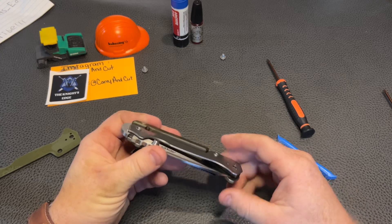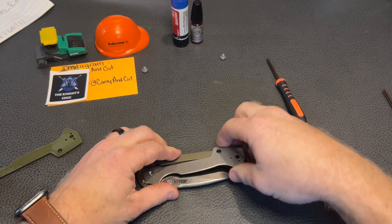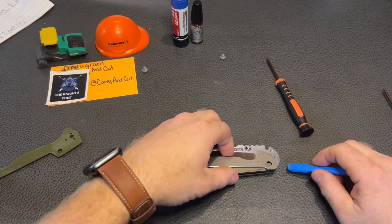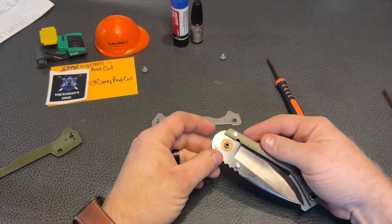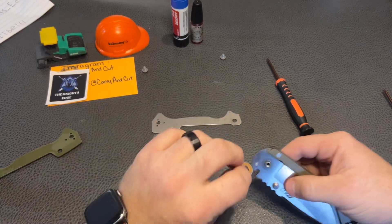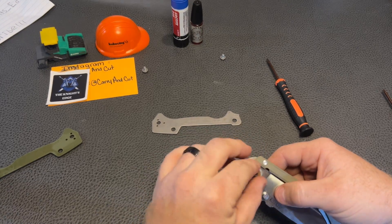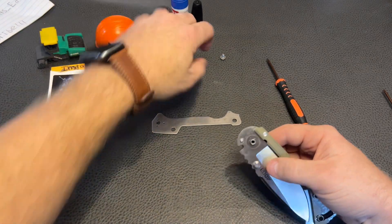There's the one side of it. Don't ever give up on what you're doing, and don't be afraid to make mistakes — this stuff can all be easily done and easily fixed. So we got our actual washers here. We had the phosphor bronze up top and the nylon against the blade — so phosphor bronze goes against the liner, and nylon goes down on the blade side. Nice to keep that straight; we don't want to mess up the orientation of that.